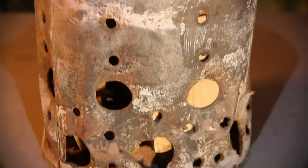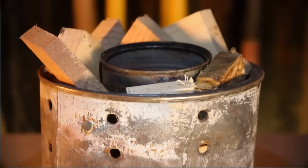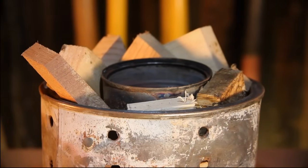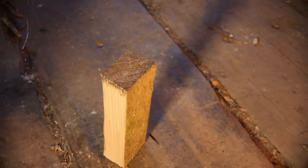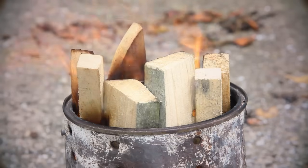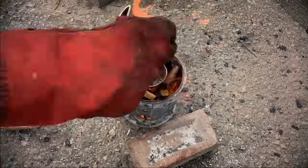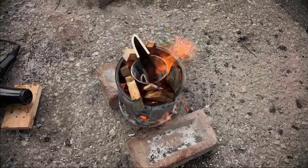If you can get hold of wood for free then this is ideal. If you have some spare charcoal this is also fine. With the wood, you want to split it into pieces one inch thick and one to two inches long — this will ensure the wood burns well but not too quickly. You will also need to add more wood as you melt.